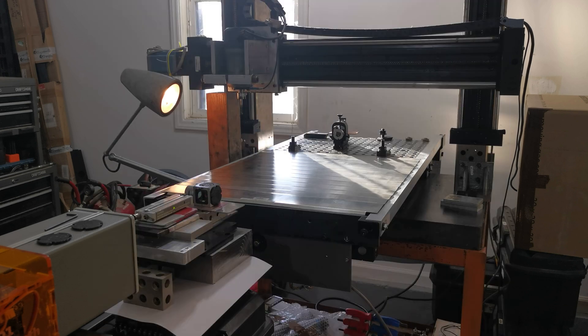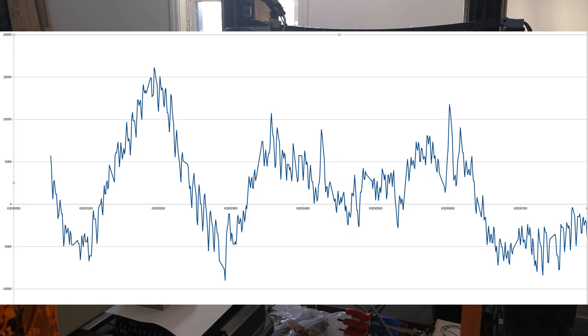What interested me very much, however, is the magnitude of these vibrations — how do they compare to the cutting chip thickness? To check this out, I logged the distance data over the 20 inch move, and then I cut off the beginning and the end where the axis was accelerating. Then I performed a linear fit and subtracted it from the data, since this linear move is what it's vibrating around.